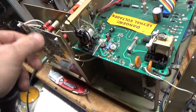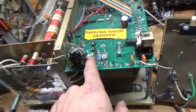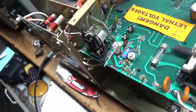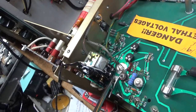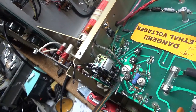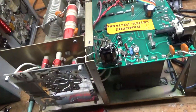Okay, the relay's been installed. I reused the original two wires that carry the RF, so it has the exact same lead length — they're nice and flexible. I replaced the bias lead with nice flexible Teflon wire, small gauge. It looked like it arced between the ground trace and the output right here at some point. This is the connection that goes over to the directional coupler for the wattmeter — for the forward and reflect. So I cleaned it out really well, and everything underneath is soldered really well.